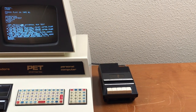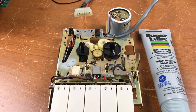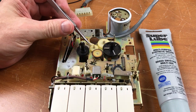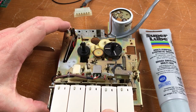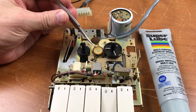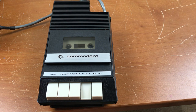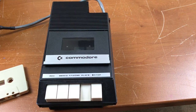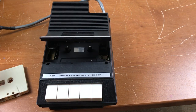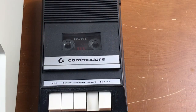That's all for now, thanks for watching. I added some grease to all the teeth on these gears just to make sure they're well lubed. But be careful not to get any grease on this vertical surface here, this tire, or the take-up reel. When you press play, this is the drive shaft — transfers to this wheel to this spindle. Greasing the gear seems to have quieted that noise a bit. However, it doesn't make that noise when there's no tape in there, and it doesn't make that noise with every tape. I'll see you next time.